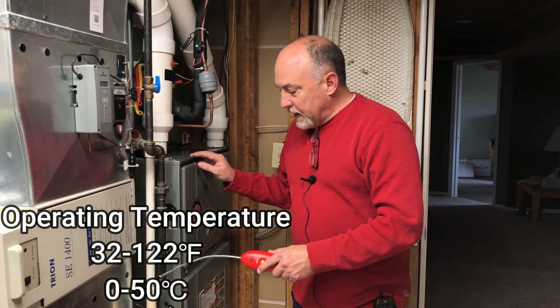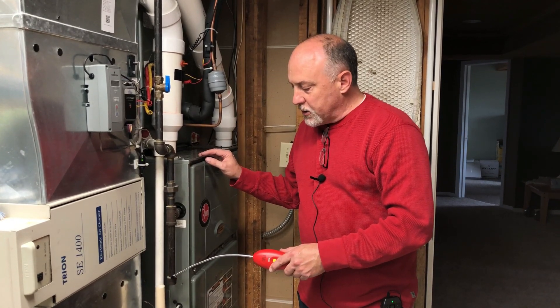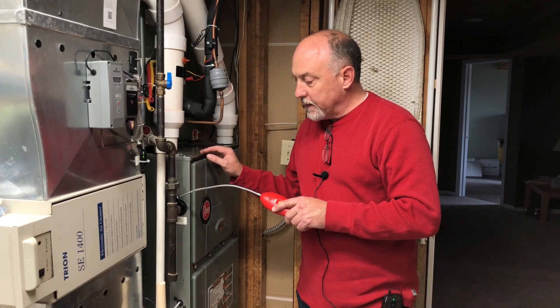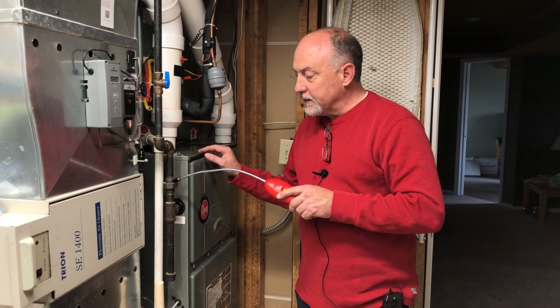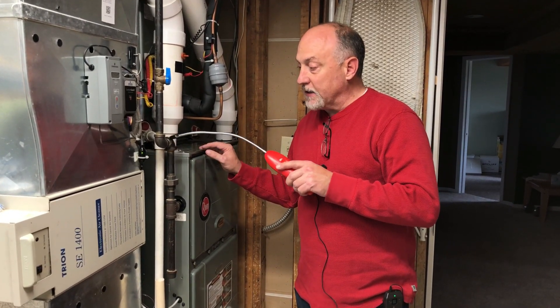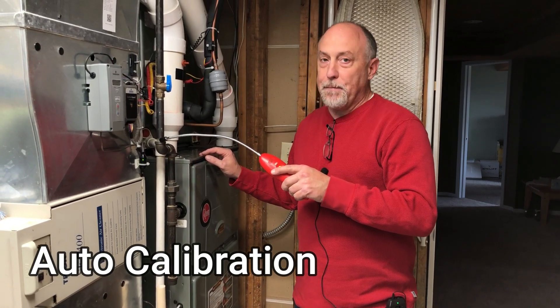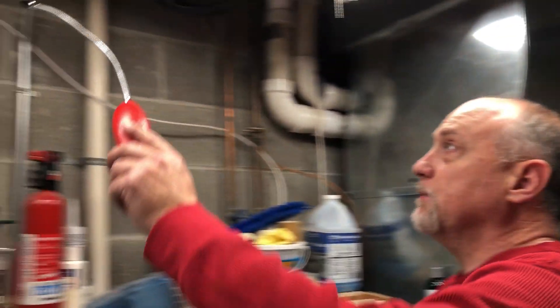You want to take this and move it about a quarter of an inch per second and go around fittings and things and just look for gas leaks. I've actually gone through my gas line before to make sure I don't have any gas leaks, but this is really a moneymaker — obviously, if people have gas leaks, we do want to fix them. Everything looks good here, but let me show you what happens. I do have a gas leak over here that I found, and it is in a tough spot up here.